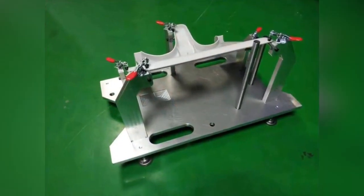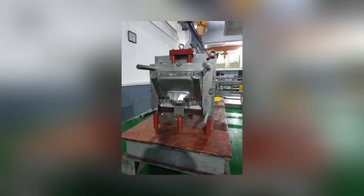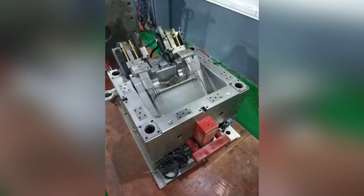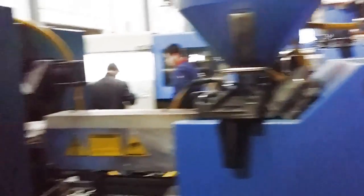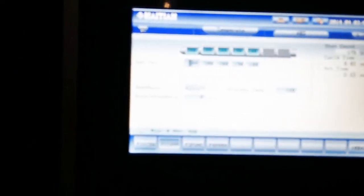These are the cooling jig pictures I posted on LinkedIn. Jigs are not only used in plastic parts molds but also in CNC machining. There are two reasons to make jigs. The first is to bring the size into tolerance — every dimension of a plastic product has tolerance. As long as the mold size and shrinkage are correct, we can try to change the parameters from the injection molding machine, such as cooling time, injection pressure, injection speed, and holding pressure.